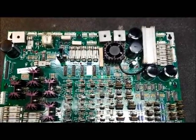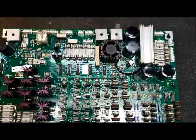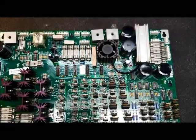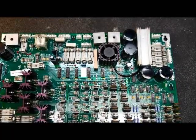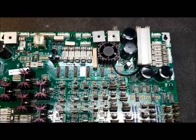I'm going to show you how I do this using Chipquik. If you have a desoldering tool, great. If you have a solder sucker, even better. But there's always going to be some little bit of solder that gets stuck behind. And with these snap-ins, they're so tight against the outside of the eyelet they can pull those things out no matter how hard you try to desolder them.